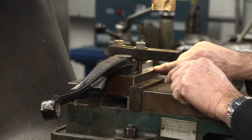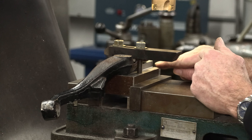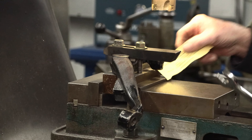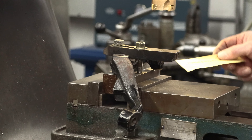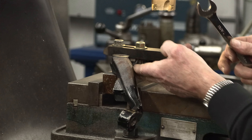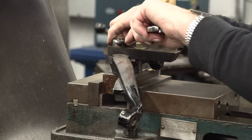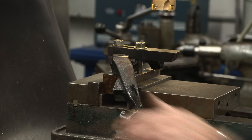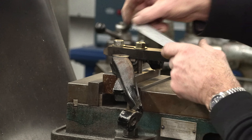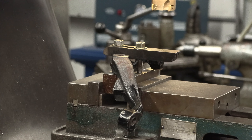I'm going to grind a little clearance right here with my sander — actually it's probably just sanding, it doesn't need to be actually ground. Get a little clearance there and then we're going to make sure we're holding down. We sanded it up. Paper goes underneath there — it's as good as a mile, right? We got clearance there. We know it's not hitting anywhere except for on our two pads down in here. That thing is stout. Now we'll come in and touch off, and we're going to take our eighth of an inch off. This eighth of an inch is actually going to come down into this material a little bit, but that's what the kit calls for.